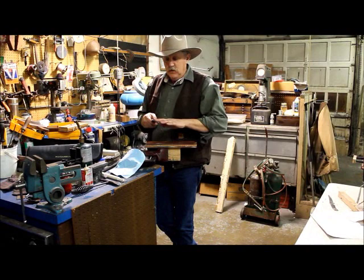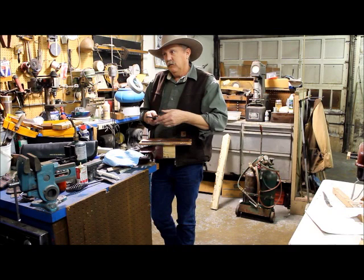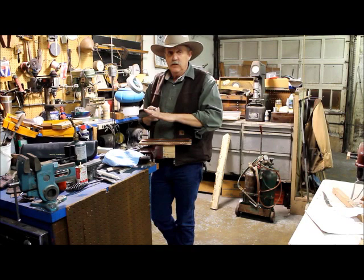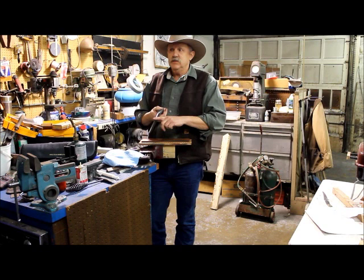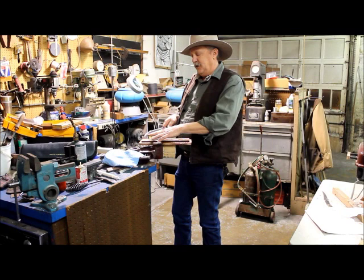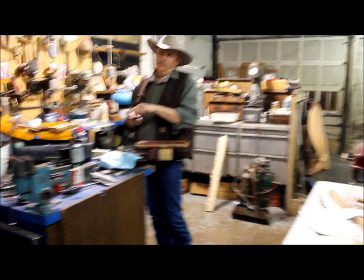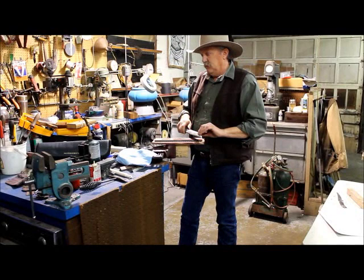Questions earlier about a clip — does it have to be sharpened? Why would you put a clip on it if you didn't want to sharpen it? Only for weight reduction — and there's nothing wrong with that. But if it's just for weight reduction, don't bring it down to a zero. I'm assuming this knife was made to be sharpened because the edge goes to zero. You sharpen it the same way, at a steeper angle. Will it take as sharp a cutting edge? Yes, it will. But it won't cut through as well because the bevel's not that long — it's too thick, hard cutting resistant. But will it shave? Yes, it'll shave as well as the primary edge. But it's a much steeper angle. You've got to be careful — don't let your hands slip.